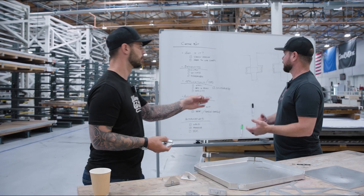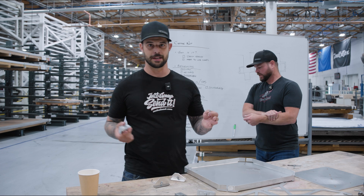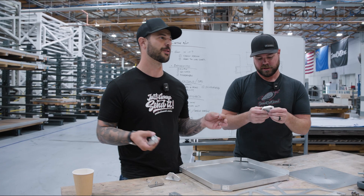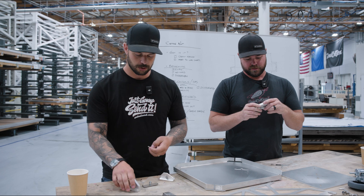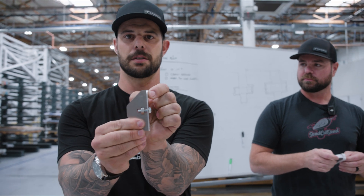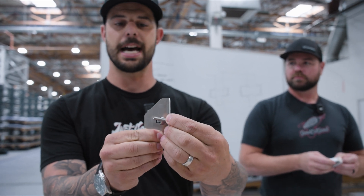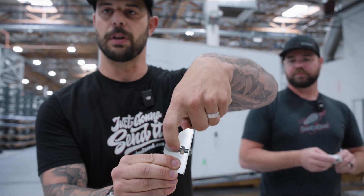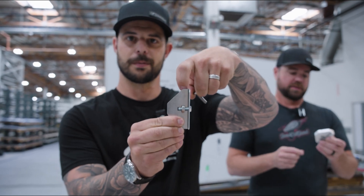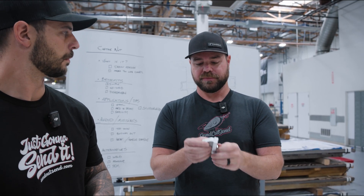You may need to allow for a little bit of taper - hit it with a grinder or a file to knock that down the last little bit. One more thing to avoid: don't bottom out. What I mean by bottoming out is that if you have a thinner material, the thickness of that material is going to determine the length of your screw. If you take a longer screw it's not going to be able to tighten because it'll hit the back side. So leave yourself extra room to allow for different lengths of bolts.